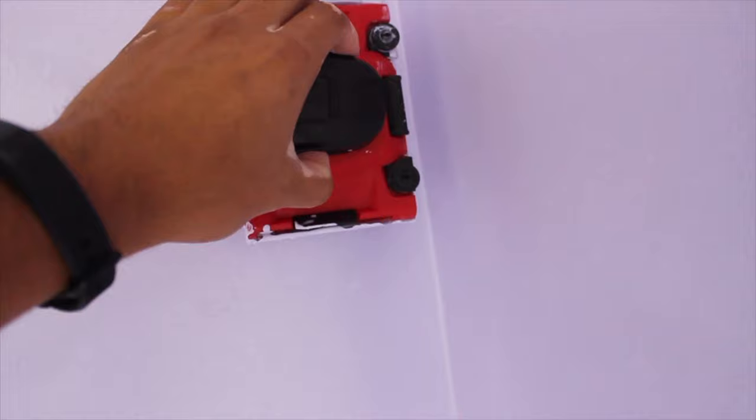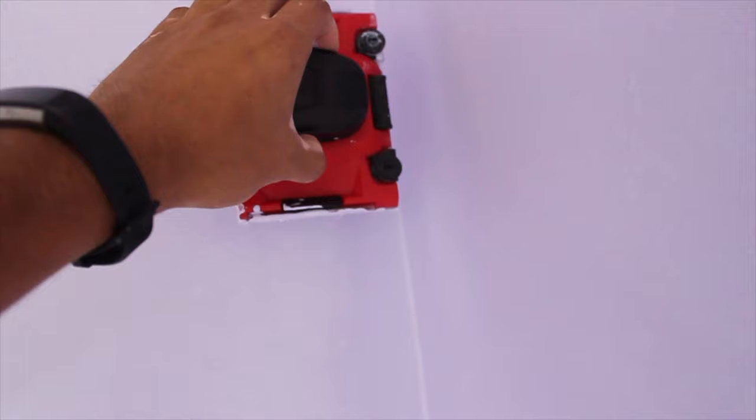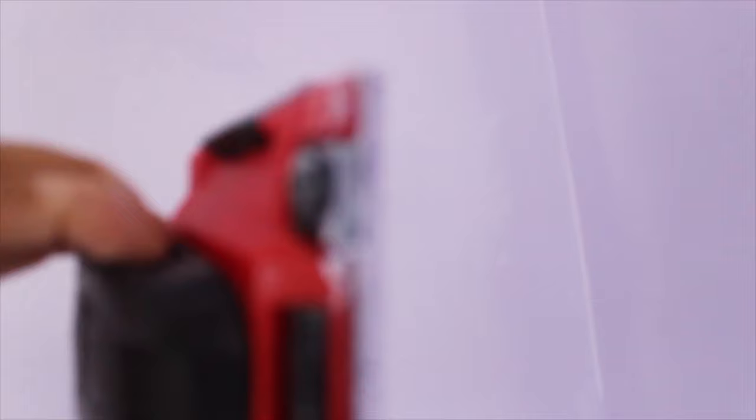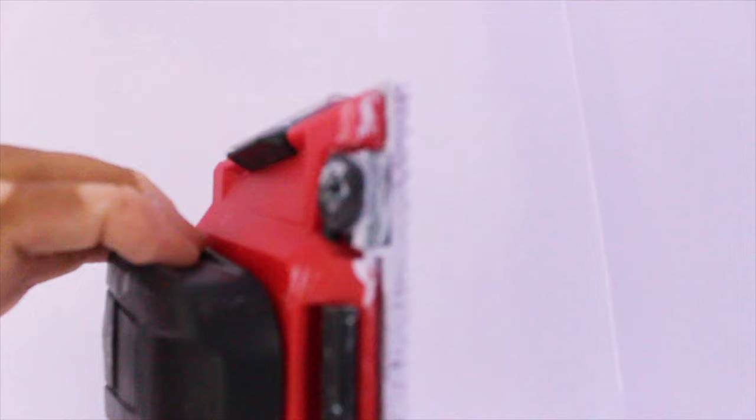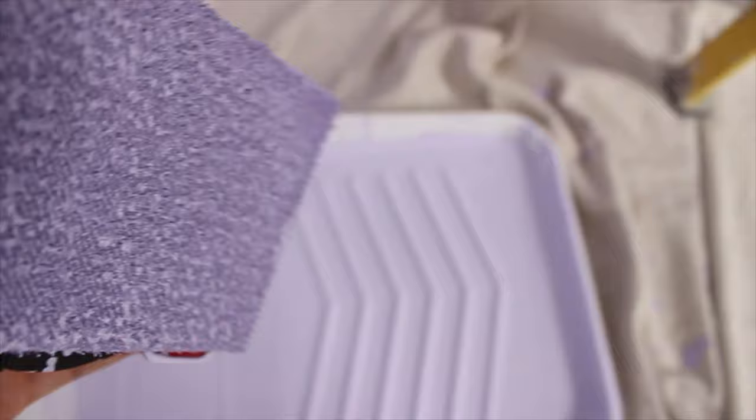Obviously you want to have your brush with you so you can comb the paint, because there's going to be a line and you want it to blend in when you're rolling the wall. We used a few different techniques: one with little to no pressure, just running it across, which seemed to yield the best results. The way I did it was with some pressure pushing down, but the issue is it would collect paint on the guard and mark the opposite wall. When loading the pad, go pretty light — make sure it's completely covered but then go light on the paint.